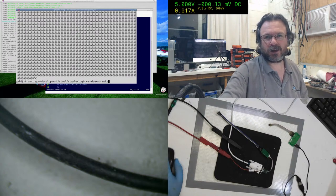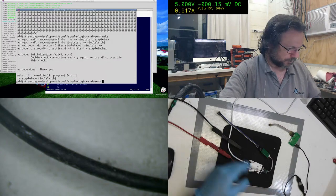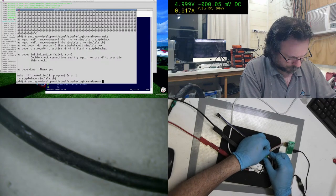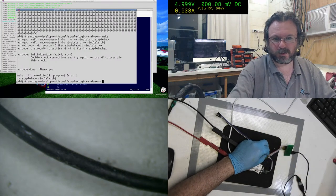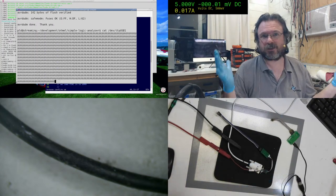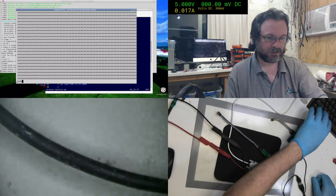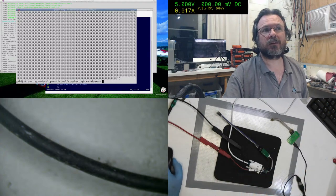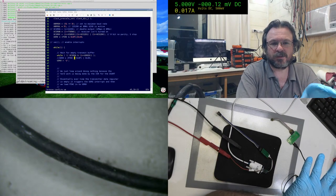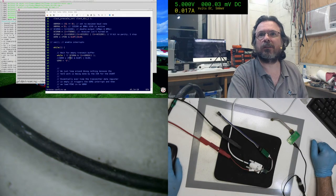I think the zeros that you see, that is when pin C is not being loaded in. It's like it pumps out a byte without pin C present. So what we're going to do is force it to not even worry about the pin data, and we're just going to make it do the letter U. And as you can see, when you pump out the letter U, it's perfect. This is what I'm talking about. It's fine. So for some reason, when I try to read pin C, it's not reading properly.